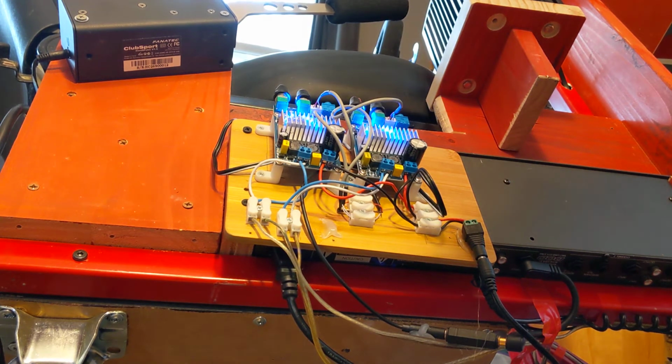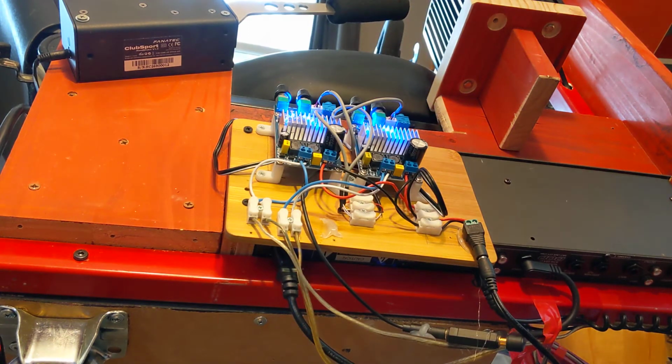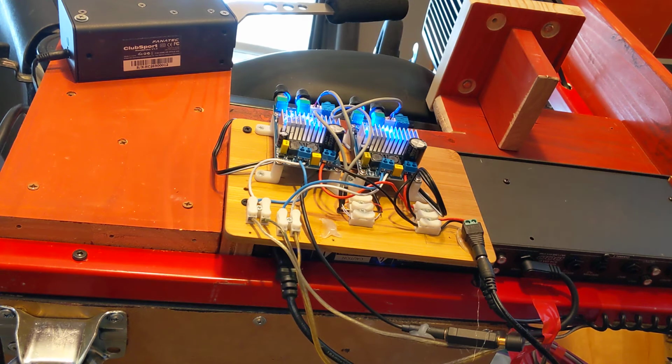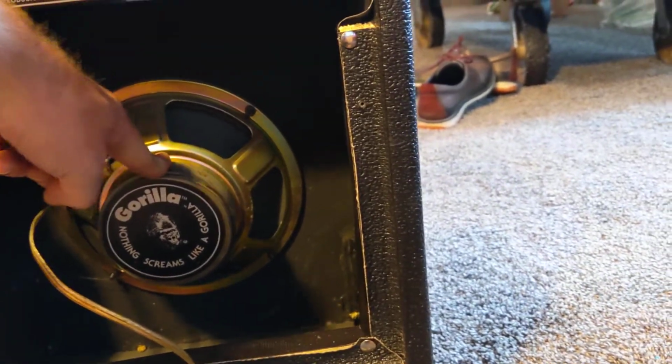This is an Xbox, and consoles are much more limited compared to PCs, because with a PC, I kind of get it, but to summarize, you use software that decides which of the sounds coming out of the game go to a specific sound card, so that then you can, for example, just drive the bumps to the butt kicker, or just drive the revs to the pedal board, some level of control. With consoles, all you're doing is taking an audio signal, and just hoping that putting the bass through some transducers like this creates a meaningful result. And a transducer is basically that, but instead of driving a paper cone, it drives a piston, some kind of weight, so that creates vibration and creates movement.